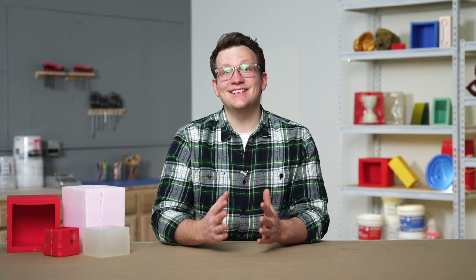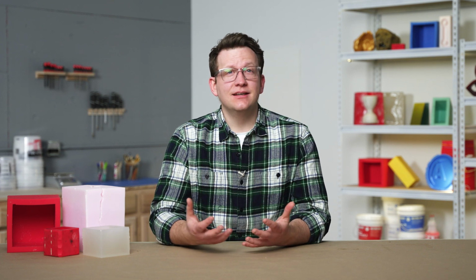One-part molds are our fastest option to getting a finished mold. They're usually done in a single pour that we can easily complete in just one day's worth of work. We can usually design our mold, build our mold box, and pour our material within just a few hours. Additionally, since the entire mold is in one piece, they are easier to create than other molds. We don't have to worry about the complexities of fitting two pieces together, accounting for odd pouring locations or seam lines. Since our mold is just one piece, it will also be easier to use. We won't spend time positioning mold halves together or dealing with other challenges that come up with more complex mold making. However, there are downsides to one-part molds.